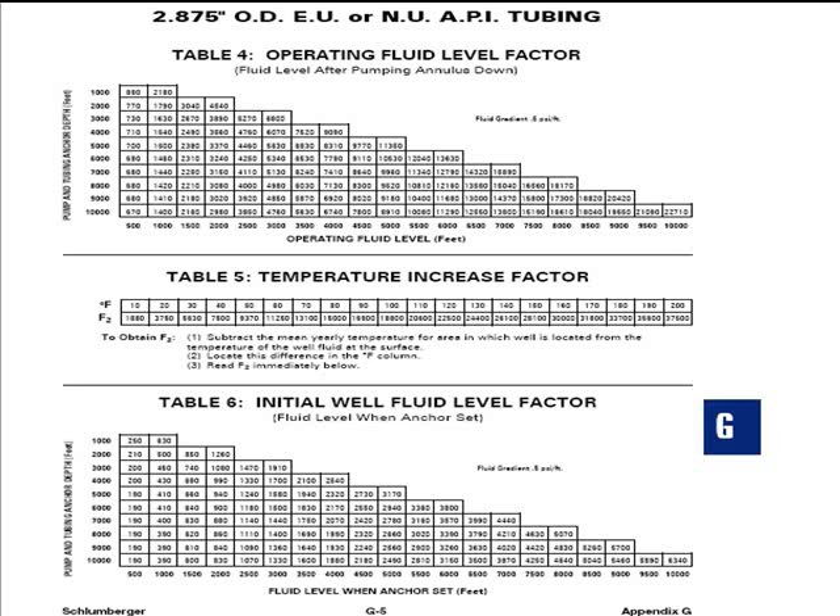Operating fluid level. There's your mean temperature minus your pumping wellhead fluid temperature, and down here's your pumping fluid level. They're all about the same. The key is, when I called around and talked to a lot of people, most people had a rule of thumb. Most of them were at least enough, but a lot of them were over-pulling their tubing quite a bit. It really doesn't hurt anything — they're well below tensile strength — but when we get into some setting procedures here in a minute, I'll show you some issues that has brought about.